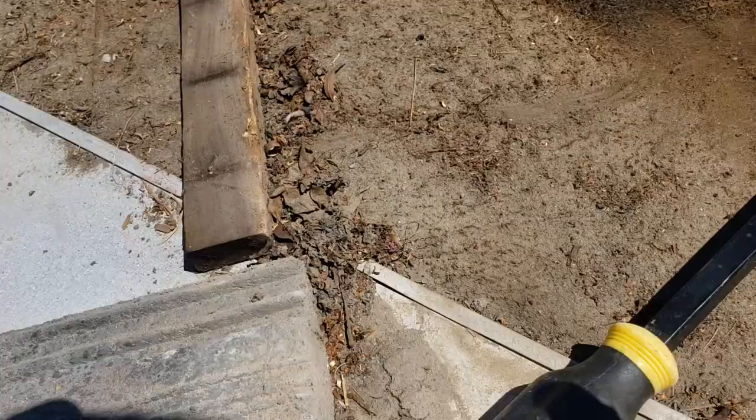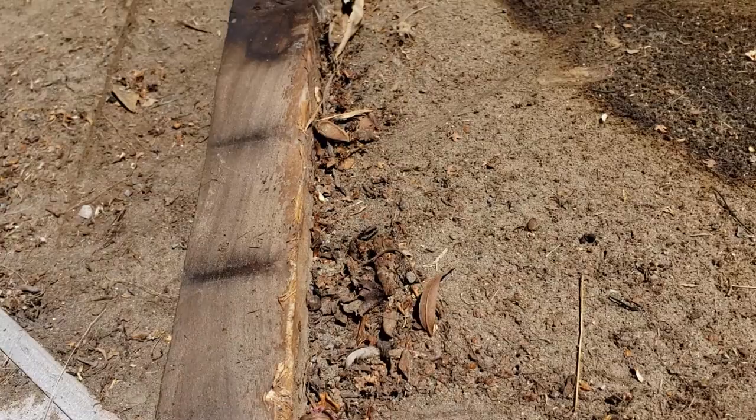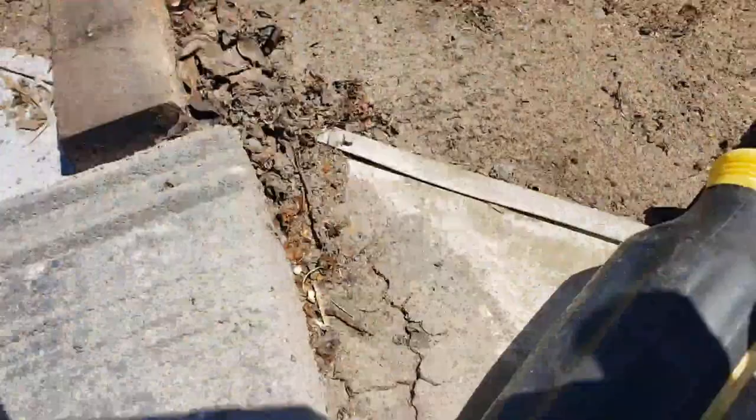This is what I've been talking about. You can see the debris is dammed up, coming across the metal and going out onto the redwood battens. That's typically what happens. You can see some discolored paper here and some discoloration on the batten, and some discoloration below the batten. So you can see the water has been traveling across here and getting in. We're going to keep searching — we've just gotten started.